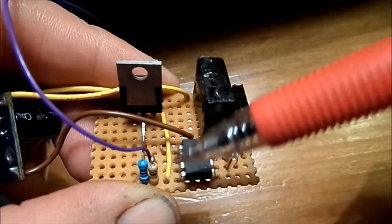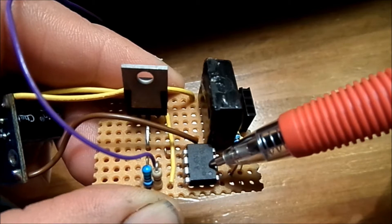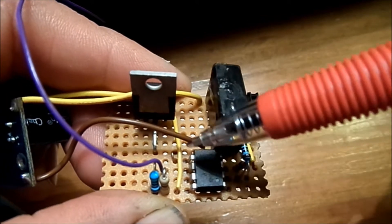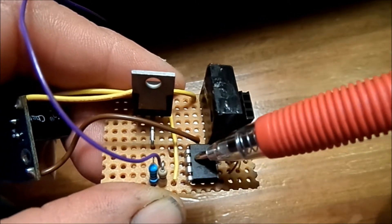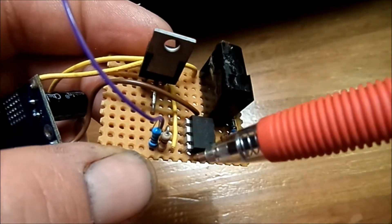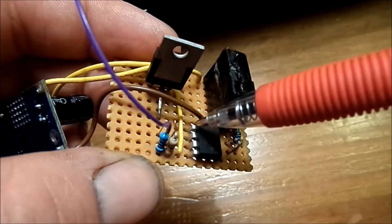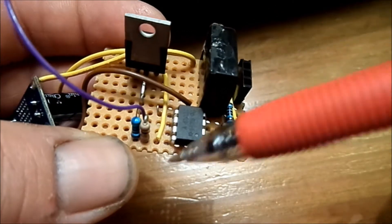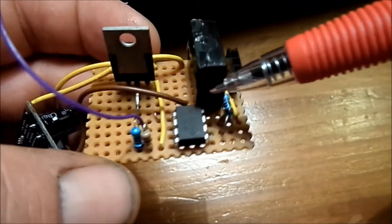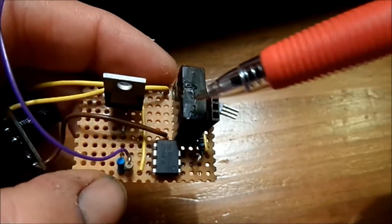There's a small diode here, and together with a 10 kilo-ohm resistor and a wire bridge, they go into the optocoupler and drive the little LED inside it. That is then fed into the receiving side of the optocoupler. Here is positive 5 volts and negative.